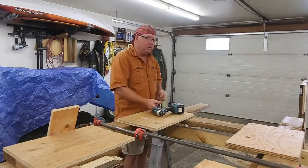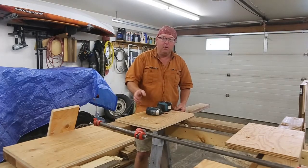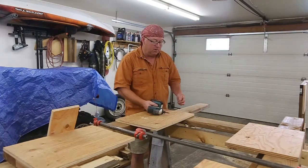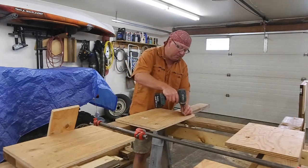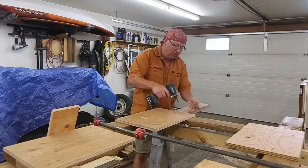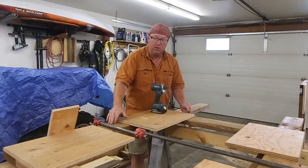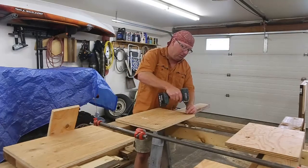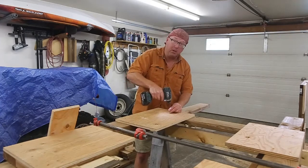Now it's important that when you're doing any of this stuff you've got to use proper wood. They're really worried — and same as us — if we get stuff that comes over and it's not the proper wood. It's not going to get into the country because it could have bugs. So you've got to make sure that you have heat treated wood, kiln-dried heat treated wood. I actually use pressure treat and I've got some documentation on it. Plywood is okay, so just be careful about what you use when you build. Don't use barn wood because it's not going to pass.